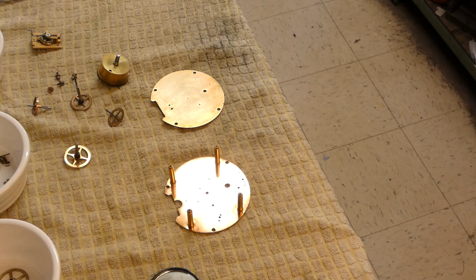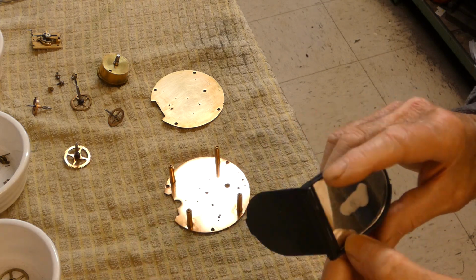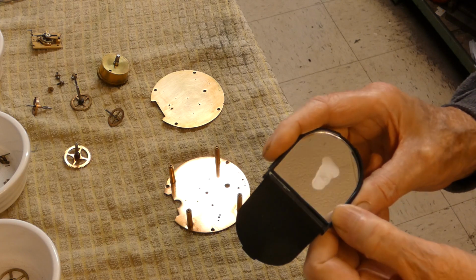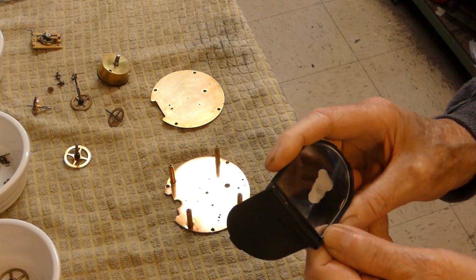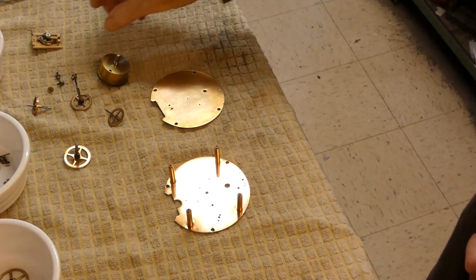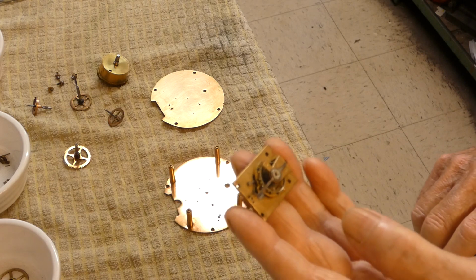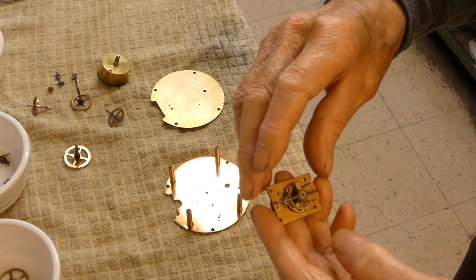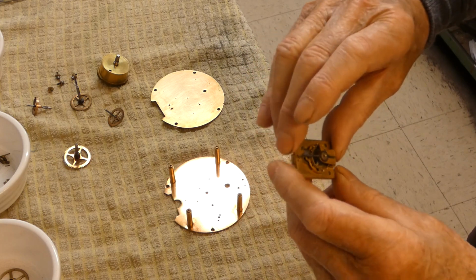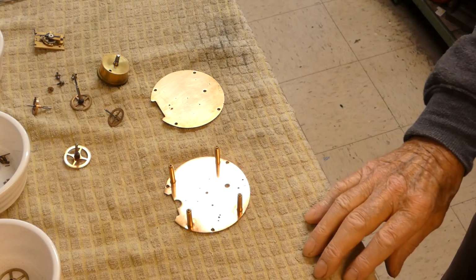Well, I made a big mistake last time. I always assumed that acetone completely evaporated, but it doesn't. I ran a test afterwards, and you can see on this piece of glass here, with a couple of drops, it leaves behind this white powder, and that absolutely bunged up the platform. So I've had a terrible job to clean it, to get rid of it, and I hope it's now working okay, but not terribly happy with that.